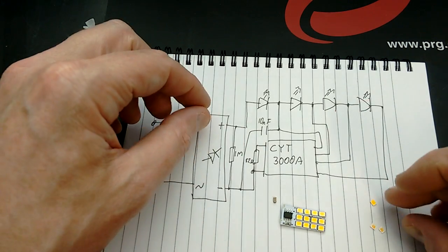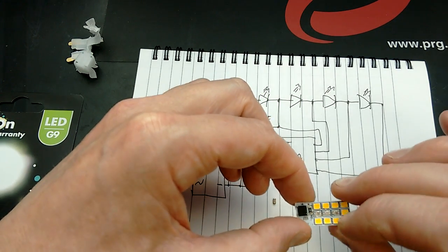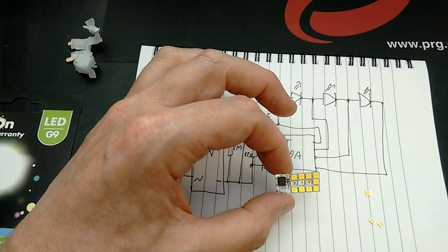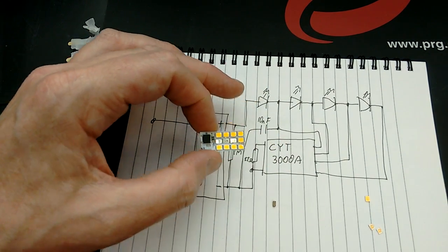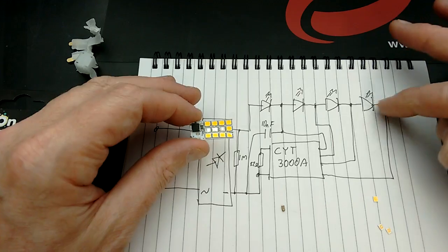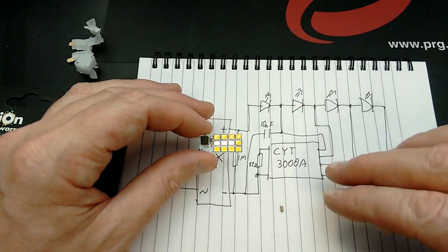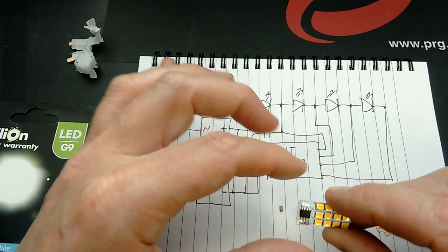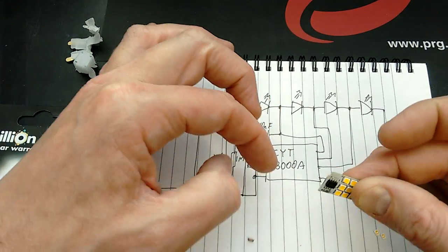The chip uses clusters of LEDs - I don't think these are single LEDs. I was trying to light some of the remaining ones with my meter on continuity test, which usually makes a single LED chip glow, but in this case they're quite large, likely multiple arrays. The chip switches them in as the voltage of the sine wave rises - there's no smoothing - so as the voltage rises, more and more sections of LEDs come on. It also does current limiting and detects overheating, regulating intensity down to reach an equilibrium operating temperature.